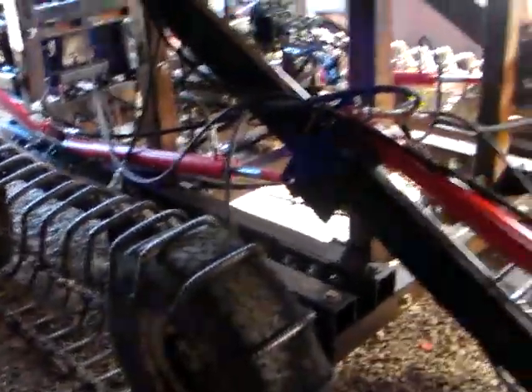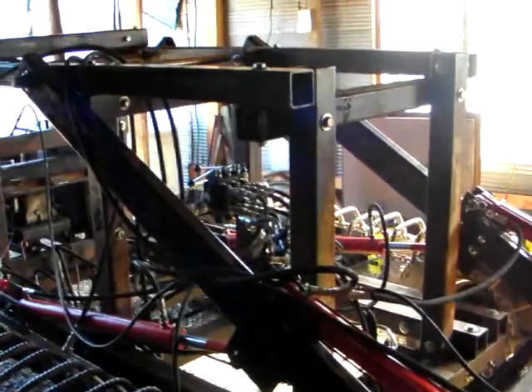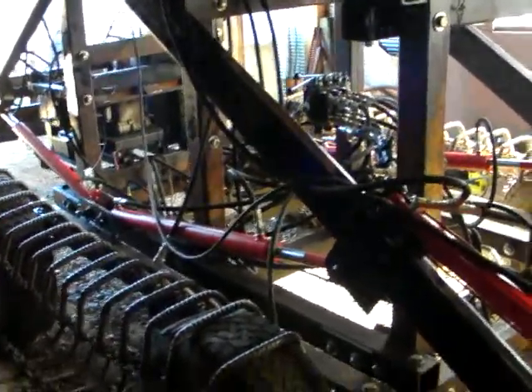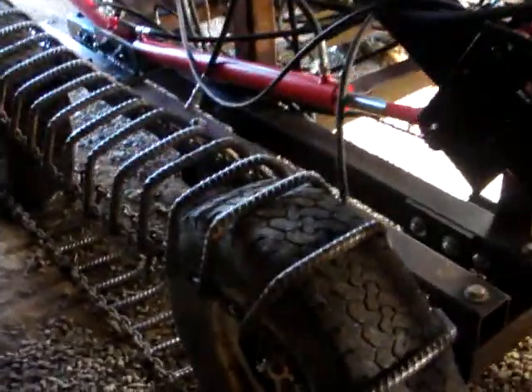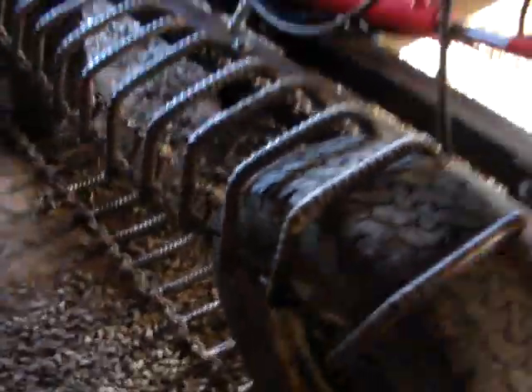And of course the tractor itself, which is fully open source — bolted together, the frame all bolted together with hardly any welds. We welded up the tracks for the wheels, bent one-inch rebar in our shop press, and welded them all together to the chain. Strap it on and the thing turns like a tank.